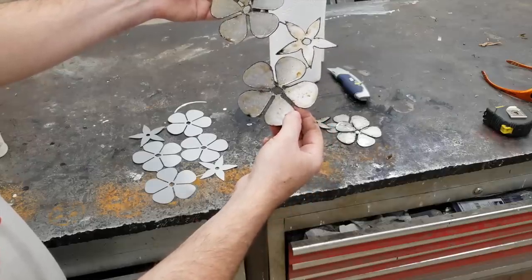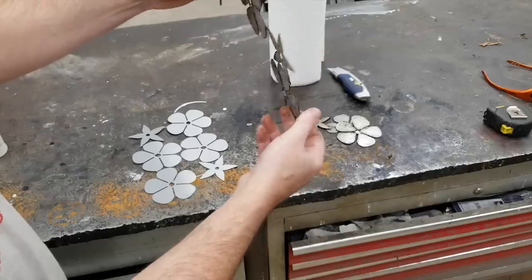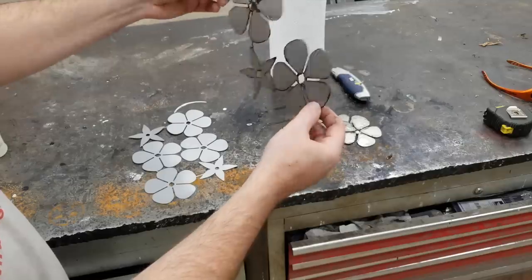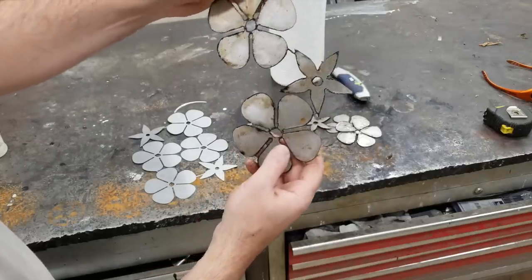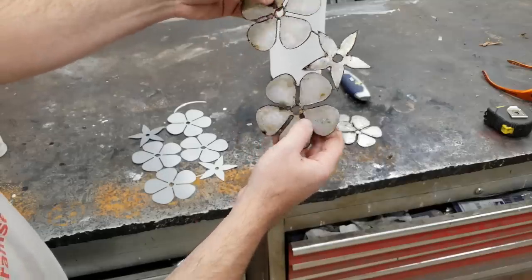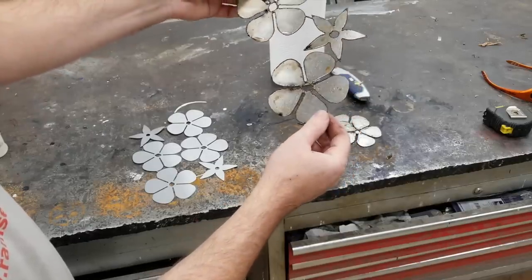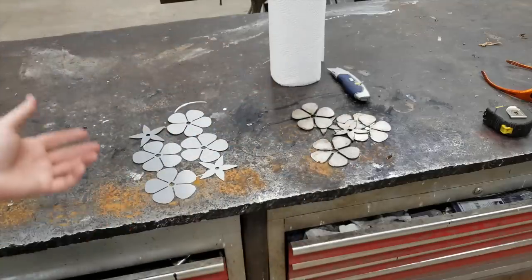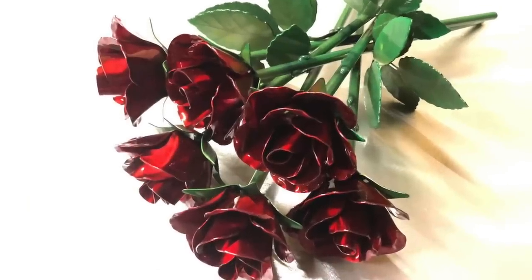I've seen guys take these and by the time you get them twisted and bent up, that dross will come off while you're doing that. It depends on how you decide to finish these, but if you're working on something you're not bending, that dross — even though some areas are pretty clean — where it is on there, it's on there pretty hard. And being able to hold that thin material while you're trying to grind it, that's just not a good solution. This is really where the laser, in my mind, really shines over plasma. On thicker materials like quarter-inch steel, you have a hard time finding much of a difference — there is a difference — but this thin material is where the laser really stands out.